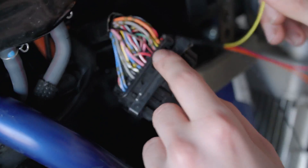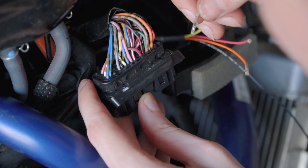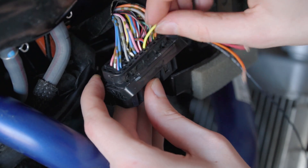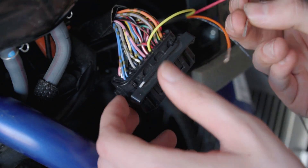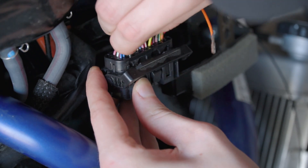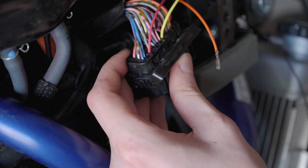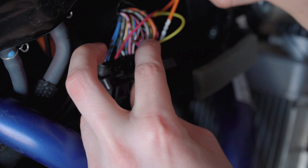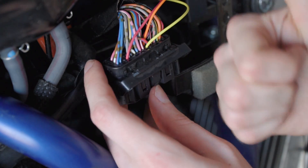Now try not to mess this up. The yellow wire will go into number six — there's a little sharp tab that faces to the front side, so just go ahead and put this into number six and push it all the way down. The yellow wire is in number six — very nice. The red one is gonna go into position 13, remember the sharp little tab faces to the front. There we go. The last one is the orange one which goes into position 22 — there we go, it's going in all the way down, you hear a little click, and now it won't come out. Perfect.